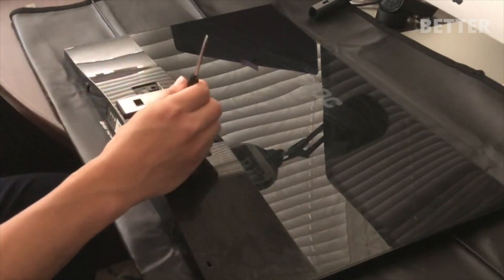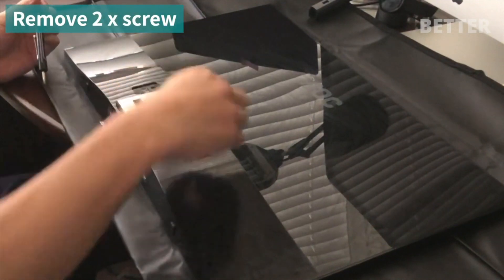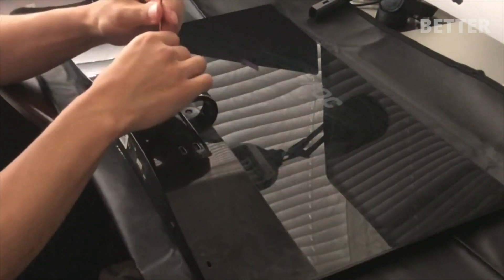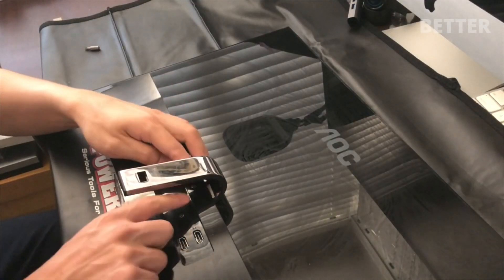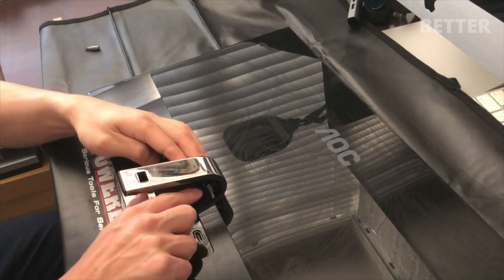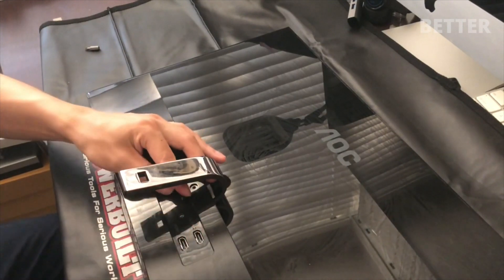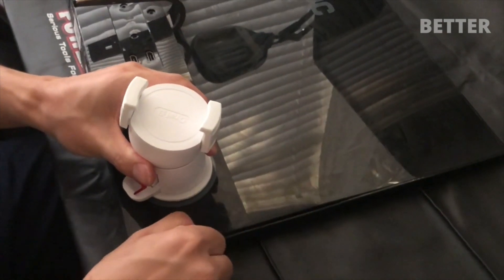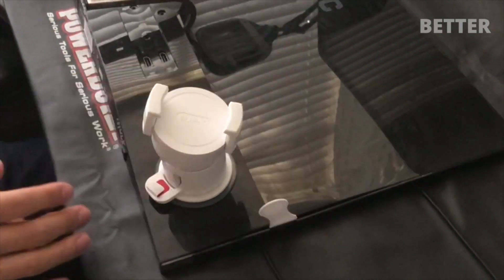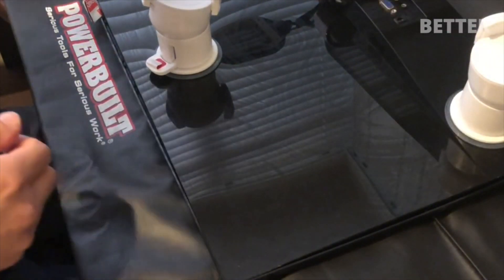Here is a short video of how I've repaired this monitor. To remove the rear panel, remove two metal screws. The center one doesn't need to be removed and it's a pain to get to — I didn't know at the time, so I've removed it anyway. You need to work around the edge patiently with a plastic pick to separate the panel. If you use a screwdriver, you'd likely dent it. Removing this panel was a little tricky, as I couldn't find anything on the internet for this particular model.